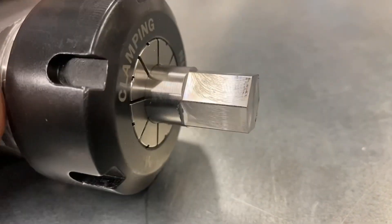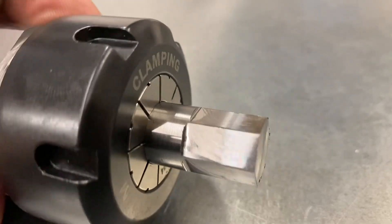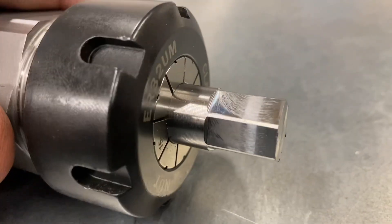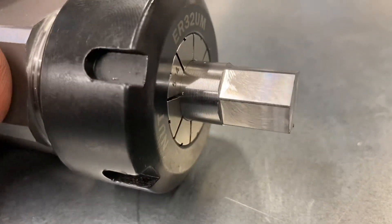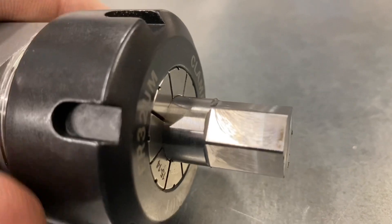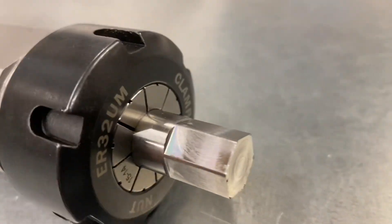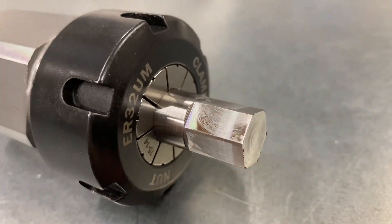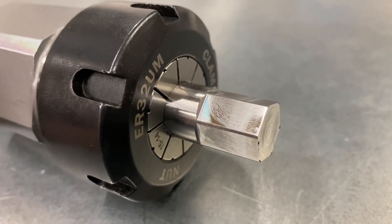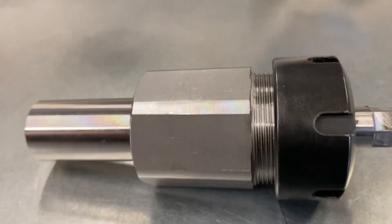There we go — that's machined all the way around, and when you get it right like that you can see it leaves the corners on and makes a nice little job of putting those hexagons on. Next operation is to put a nice chamfer on the front edge, and then we're going to drill the hole in the back as well.